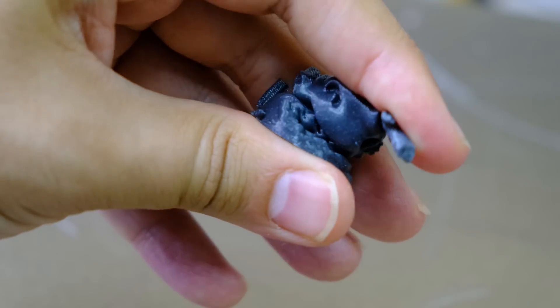It is true that it is not going to be a very fast print. I have done things with some 95A or 98A Shore hardness flexibles — slowly and carefully, the retractions have worked well. 95A and 98A are the softest flexible filaments I have used. If you have no idea what that is, there is a video here where we talk about flexible filaments, which was very, very good.